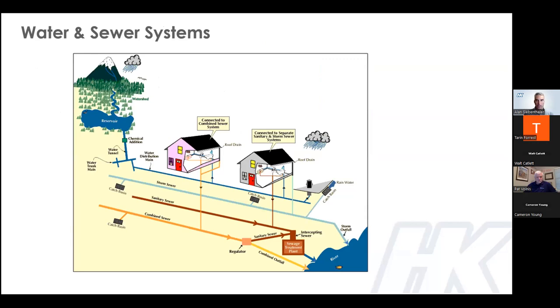Here's an illustration for anyone who might not be familiar with sewer and water conveyance systems. Gaskets are used to seal connections in water distribution pipe, shown in dark blue. But the primary use of gaskets I'll be discussing today are used on pipe for sanitary and stormwater collection systems, shown in white, blue, and brown on the screen. Some cities still have combined sewer systems installed decades ago that may discharge sanitary water into waterways during heavy rain events, though most cities have taken steps to limit or eliminate these events.